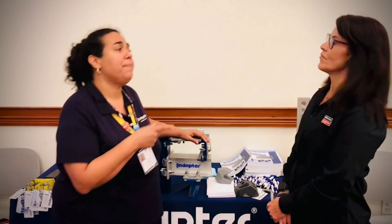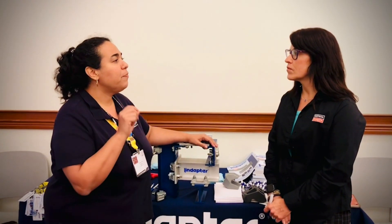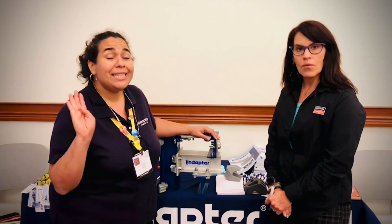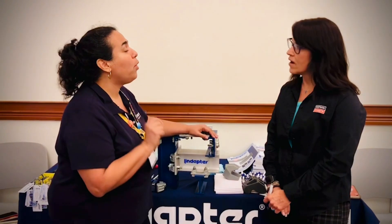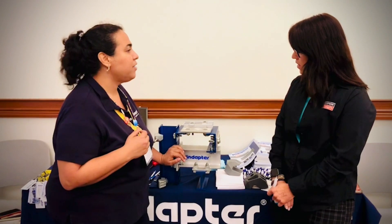One other really important piece is that these ratings are based on differential movement of 0.004 inches of movement — that's 0.1 millimeter of movement. Therefore, these are considered fixed connections.